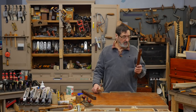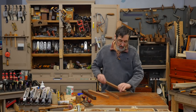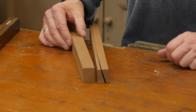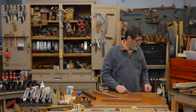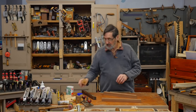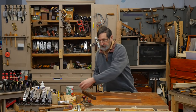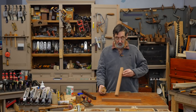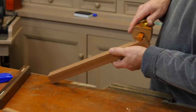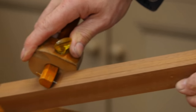First of all, here is the actual size of the ones we're going to make. I took this from here — similar size once you've taken the saw kerf out. My first task is to set this gauge to 11/16, which is 17 millimeters. It doesn't matter which edge you run the gauge from at this stage. This is the narrow face, the one-inch face, so we're running the gauge along here and you can go quite hard on this because you want a definitive line.